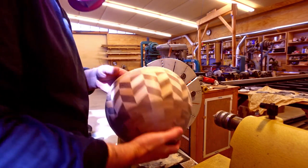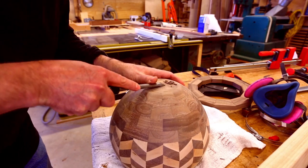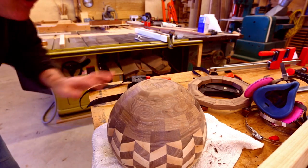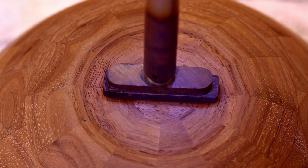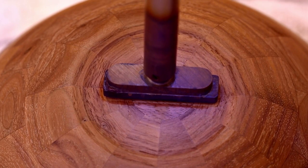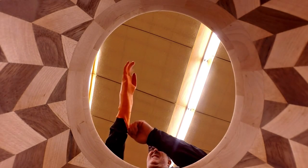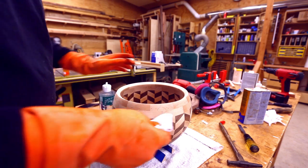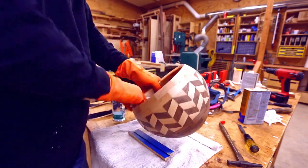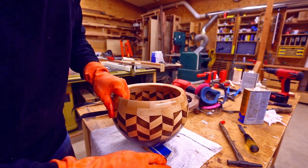It looks pretty good. The last thing to do is cut off the little bit right at the center of the bottom, which took a while — I need either a curved chisel or a vise that will hold it on my table, but this seemed to work. I wanted it nice and flat to put my brand on the bottom of the bowl. I rocked it back and forth and thought I had it just perfect, but it didn't quite come out right — but that's what gives it character. Then some finish: I'm trying butcher block oil, which went on really nice. It's got kind of a matte finish, isn't too shiny, and it's food safe. I'll let that dry.